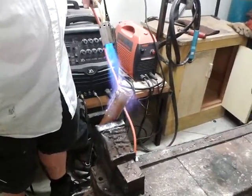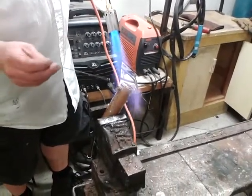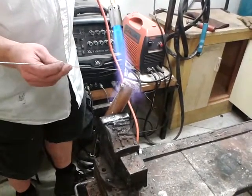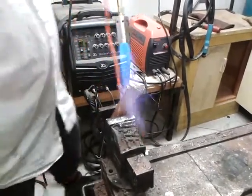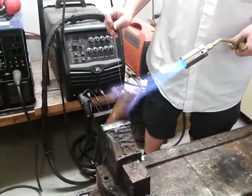We've got to get this up to red heat. You don't want to hold the work too close to the nozzle, because that part of the flame is cold — it's where the unburned gases are. Think of it like a Bunsen burner in science, except a bit bigger.